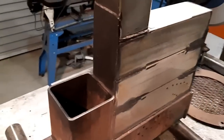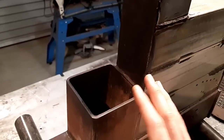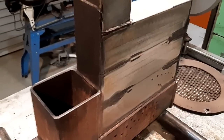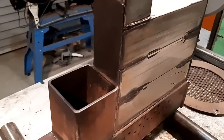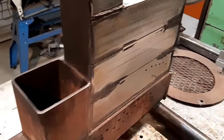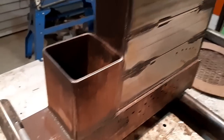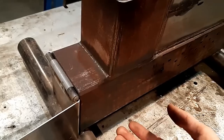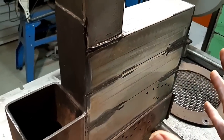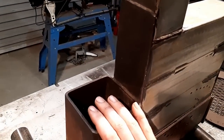And so the idea is to burn this stove, to run it hard and hot, to light it once and walk away and let it build up heat. It is going to have insulation around it. Let it build up heat, store it in the thermal mass. And when it goes out, yay, that's great. I don't have to relight it. I don't have to worry about clearing out the ash. I'll do that when it's cold, but it will have stored all that heat in the thermal mass and just continue to leach it out for a couple more hours after the fire is well and truly gone.